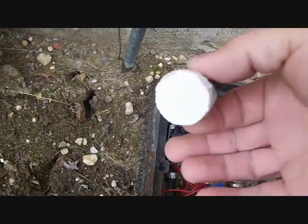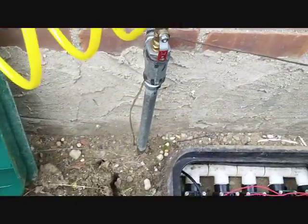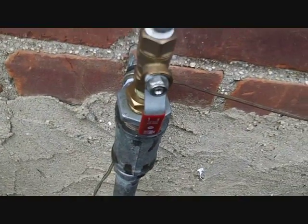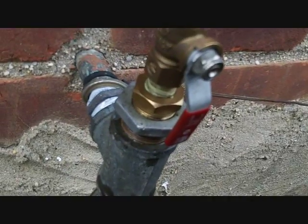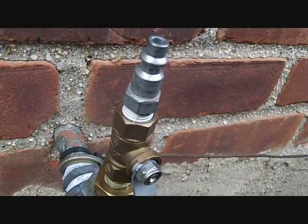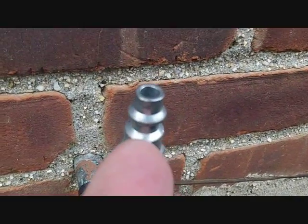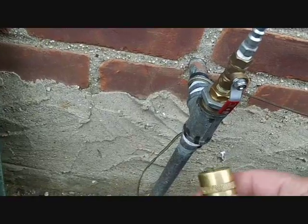as so. So you unscrew the cap and you got to make one of these contraptions. Pretty much what I did was I put a 1/4-inch shutoff valve and I kind of tapered it into the 3/4-inch fitting that's in there. So you go to the hardware store and you put one of these ends, quick disconnect, to your air compressor.